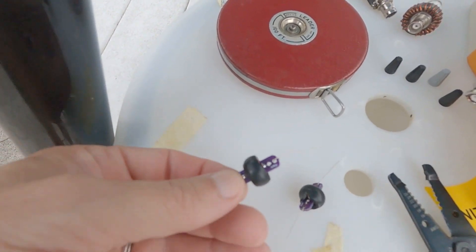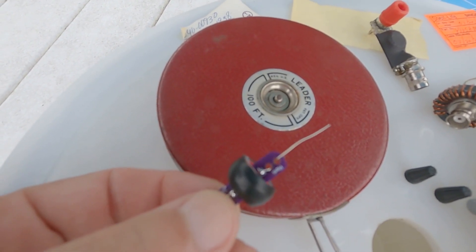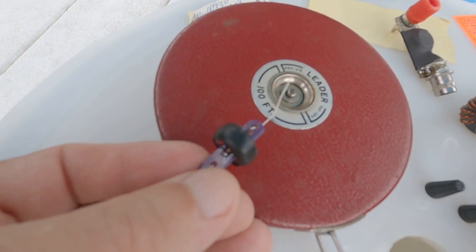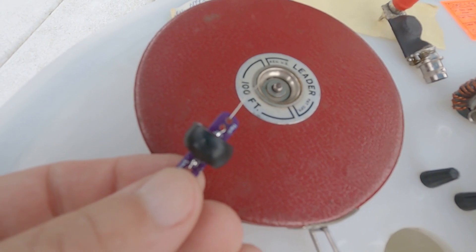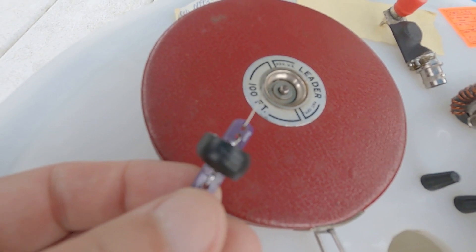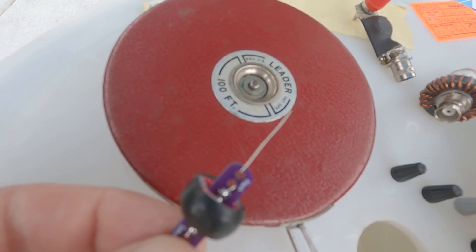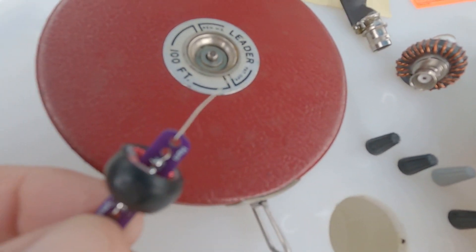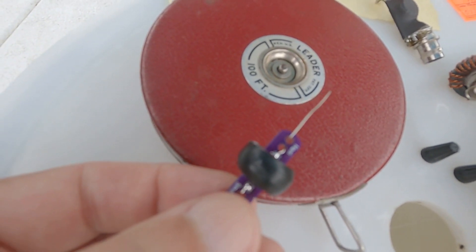On the traps, I attached a small piece of solid core wire that I routed through the strain relief holes and then soldered onto the pad on the board. The idea is I'll use this in the tuning process - feed my flexible antenna wire through the strain relief holes and use wire nuts to connect it up. I'll trim the antenna until it's tuned, then solder everything up without having to solder and unsolder during the tuning process.